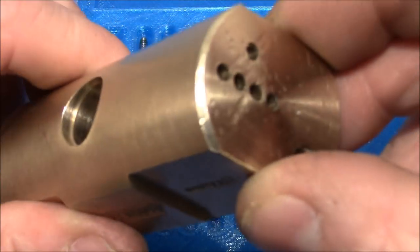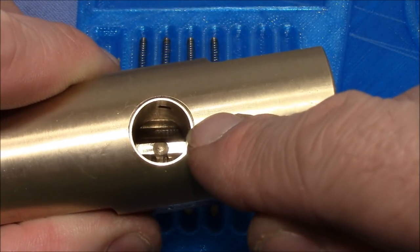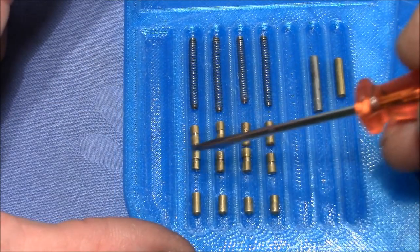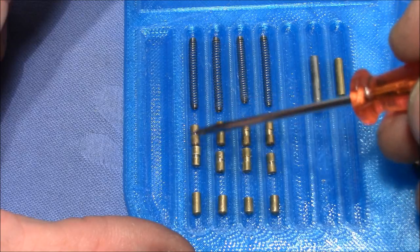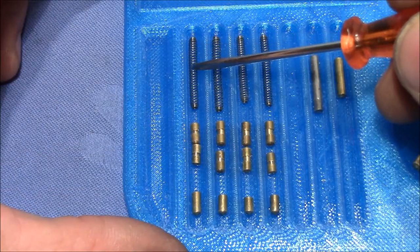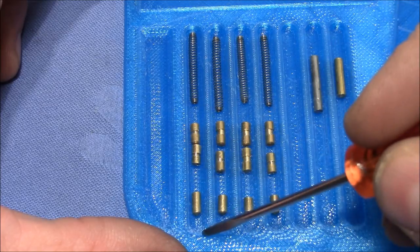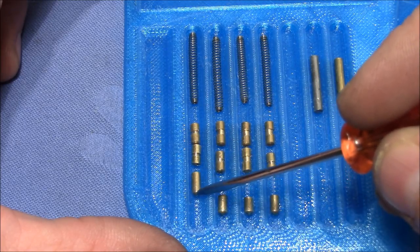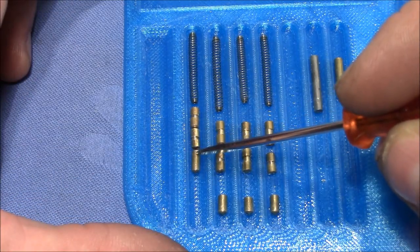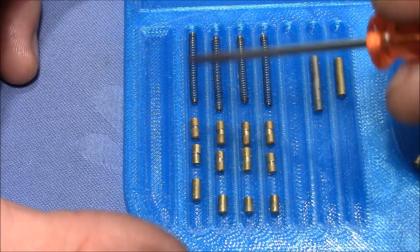Very long springs because the shackle is very long. You can see that's the end of the shackle and it has to reach all the way here to the plug. So we have very long springs, and maybe that's also the reason why we have two drivers in every chamber, because maybe they didn't have a spring that was even longer, or they wanted to prevent an overset attack, where you push everything in the shackle and then can open up the lock. But maybe they have just needed some additional pins to fill up the space.